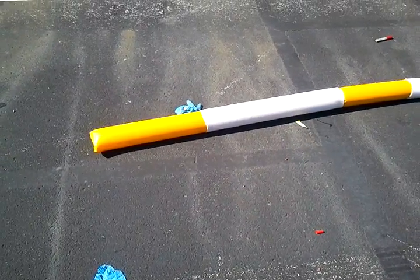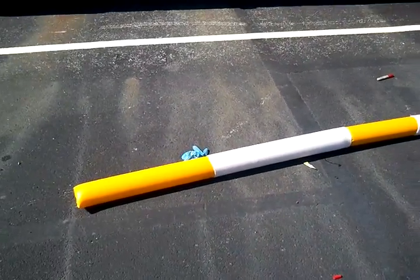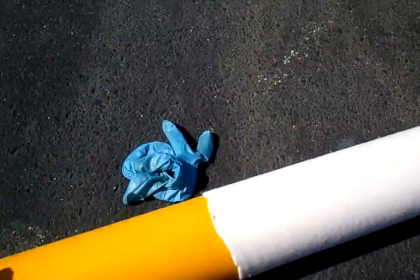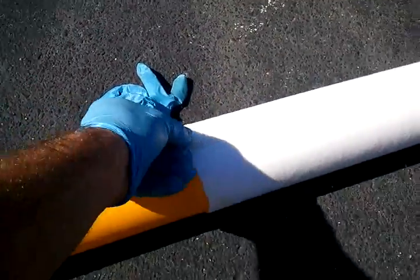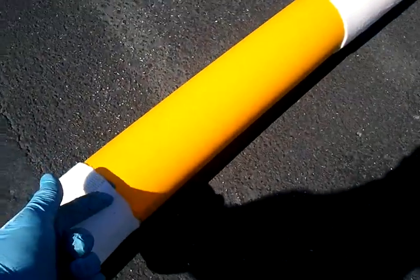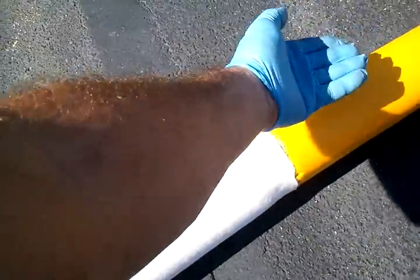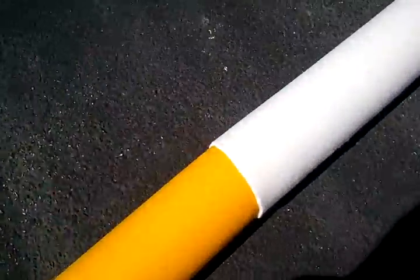When this is all done curing and you wind the liner back in, this lagging edge of the liner is unglued. So as the balloon rolls back in, it won't tear this liner off the wall. When the balloon gets over here, there's no way for it to peel off the wall because it's actually just tearing away. And on this section the balloon's going in, there is no glue.